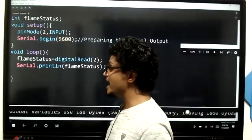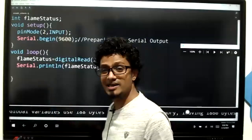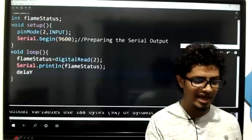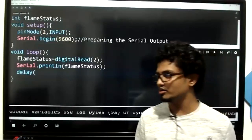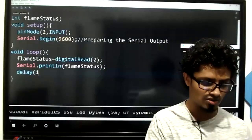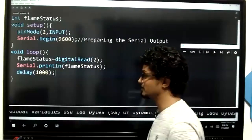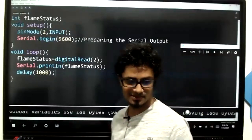And then, wait. Are we having any delay? That's why this is so fast. We don't have a proper delay here. So let's add a delay to this loop. Let's say this should happen every 1 second. How can I have a delay of 1 second, kids? Delay should be what, kids, for 1 second? 1000. Very good. 1000 means what? 1000 milliseconds, right? Okay. Not 100, it should be 1000. Right. Delay 1000. Everyone focus, kids.